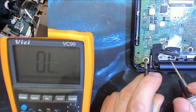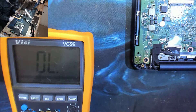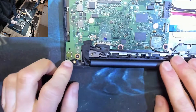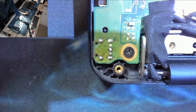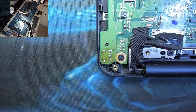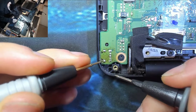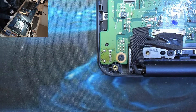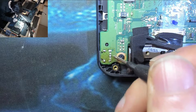The whole thing is shorted out. So is that bridged or internally shorted? I'm going to have a very close look at this first — did I bridge those solder joints? Let's just touch up those joints. I just touched up that connection — there are definitely no bridges there by any stretch of the imagination. But we're still all shorted to ground. So my guess is this positive line is internally shorted in the circuit board.